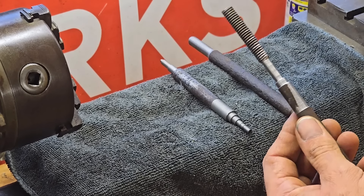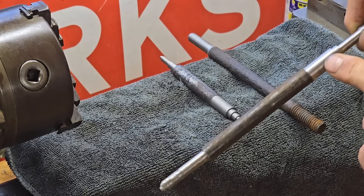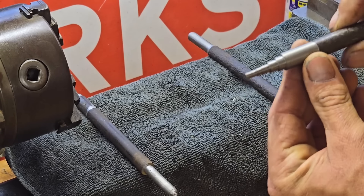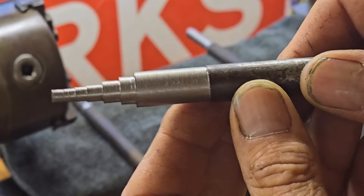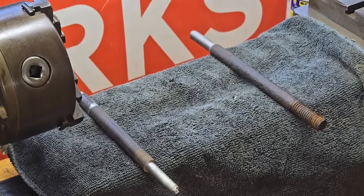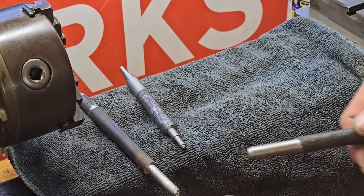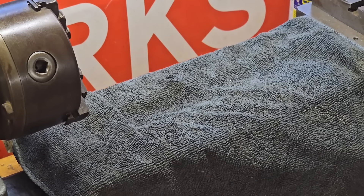This is half a bolt which was very bent, but I've managed to get a little bit of a finish on here. Not brilliant. Then I moved on a bit, trying a different bit and a different speed, and this has come much better. These were just old rusty bolts, probably not a good quality steel. That's the bolt it was made from - we've started to come a bit liney. But I think I'm getting the hang of this turning business.